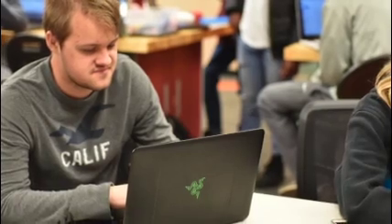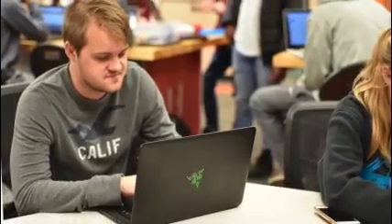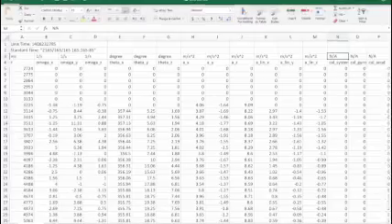For the coding portion of our project, we first had difficulty downloading and installing libraries into Arduino Sketch. Then we had difficulty writing to the SD card and keeping the SD file open to write to. And finally, we had trouble with our sensor and getting it to calibrate, even on launch day.